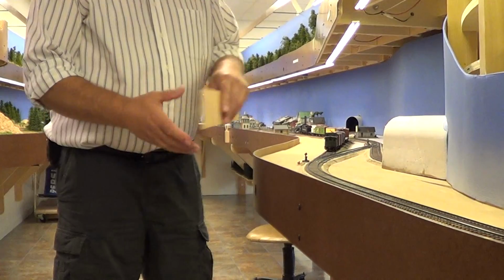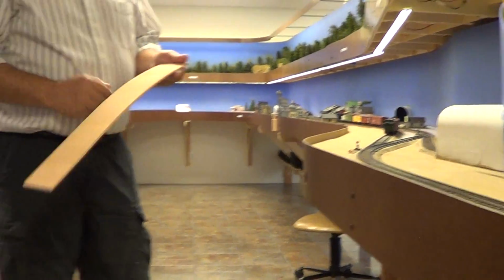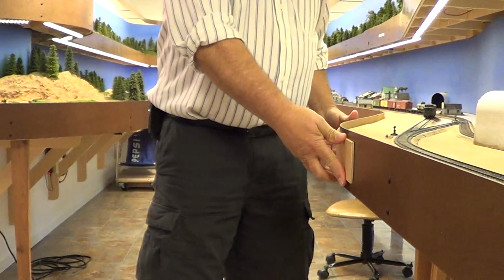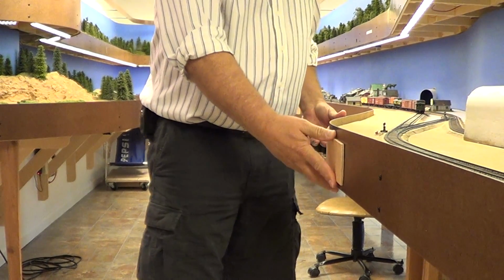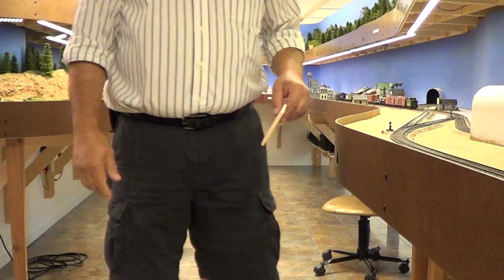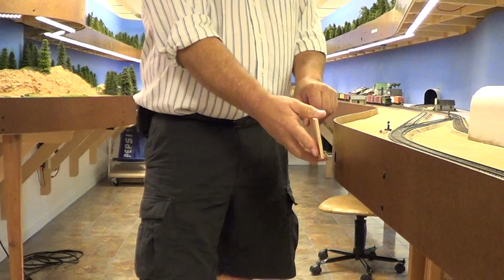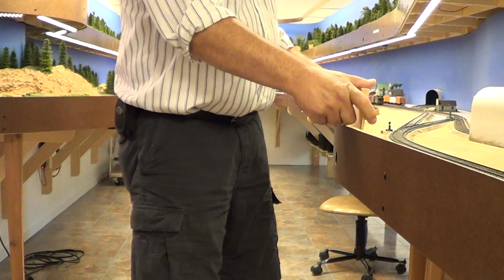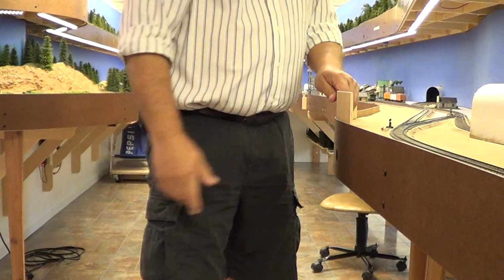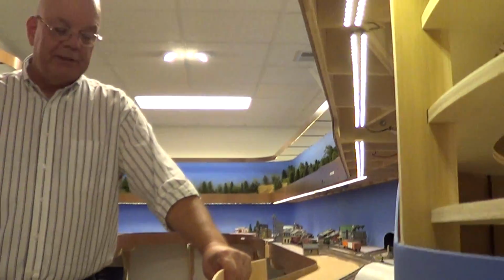And then I take a second layer and I bond it with glue over the whole surface to the outside of the first one. And I use binder clips from the office supply store, 1/2-inch binder clips, every couple inches on the top and the bottom, and you're left with a piece of 1/2-inch thick plywood that is very, very strong. It's just as strong as the other 1/2-inch plywood, and that will bend to any radius down to 6 inches.